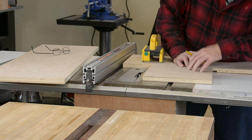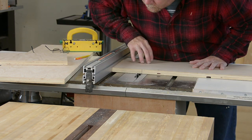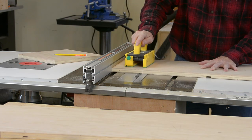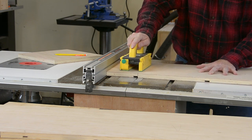I don't have enough table saw capacity to cut the very last dado using that same method, so I just used a divider piece to measure and mark the first one. But I did set the fence so I could cut both sides the exact same distance. The shelf may not be exactly where it's supposed to be, but at least it'll be straight.